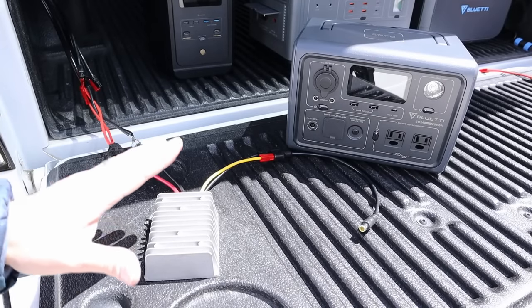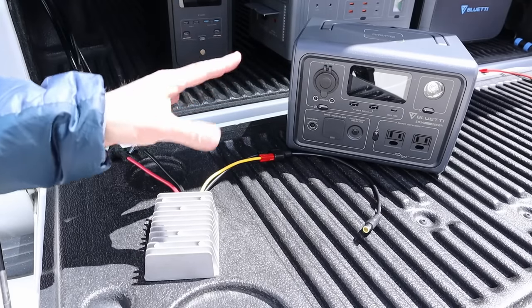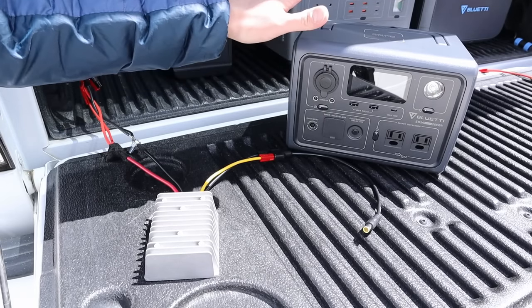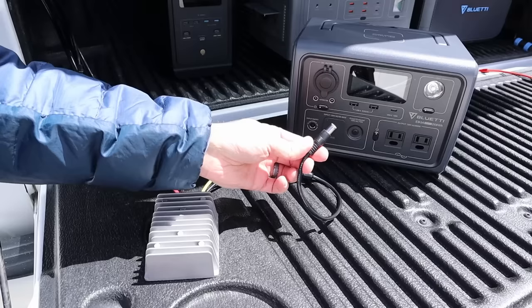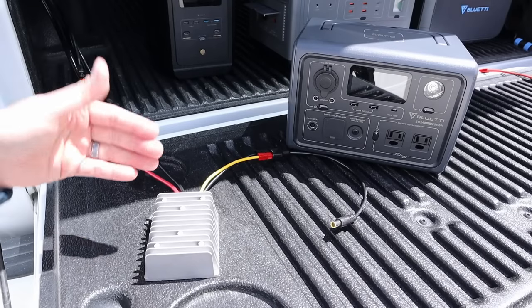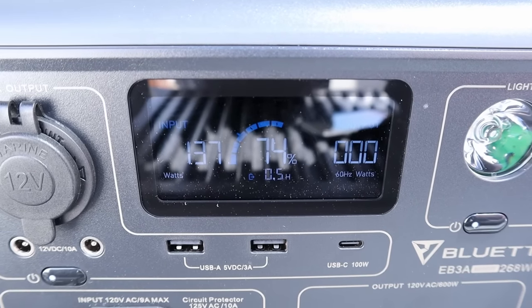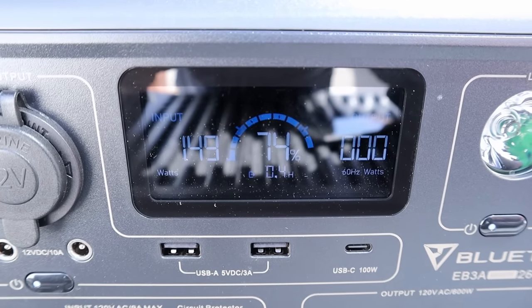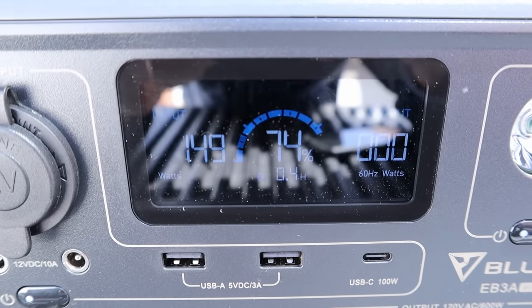For the final charging demo, I'm going to show you the small boost converter with the Bluetti EB3A. Because this puts out 24 volts and most small power stations have a limit around 28 volts or a little bit less, this is still compatible. You do not want to use the higher voltage boost converters on your small power stations. This has Anderson PowerPole coming off, connected to a 7909 adapter that plugs right into the Bluetti EB3A. When we start this up it's going to basically behave like a 200 watt solar panel. On the EB3A it's jumping around — I've seen 149, 137, and it also went up to 180. Maybe this specific boost converter doesn't work perfectly with the EB3A, but we're still charging faster than we would at 12 volts.